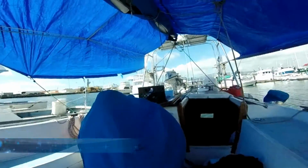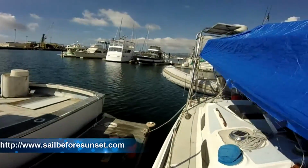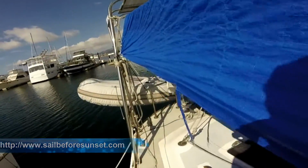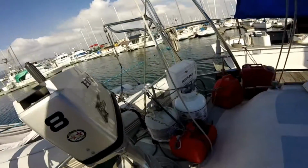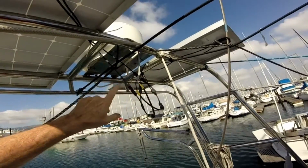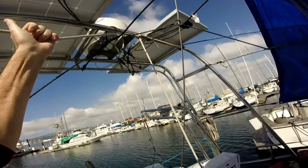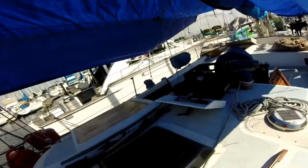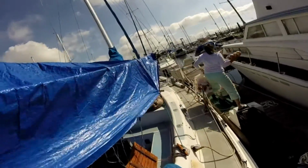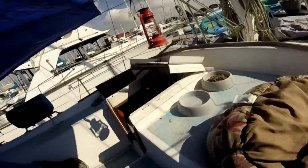Here we've got the MPPT controller, and I've had two solar panels mounted up here on the back for some time. I actually put them up months ago to get them off the deck. All I have left is to seal the connectors and dress the wiring. I'm going to silicone around it, tape them off, and then zip tie everything up. That's 200 watts mounted up there, and we've got new tarps we're going to put over this beast too. So that was one of my projects.